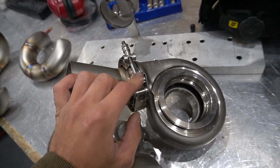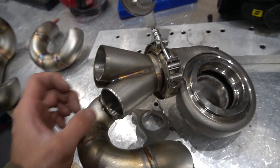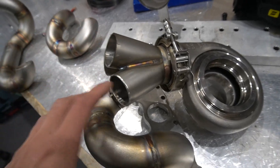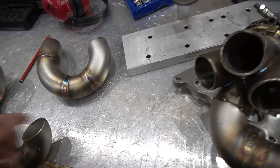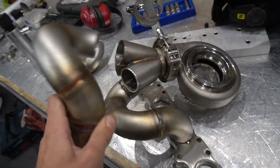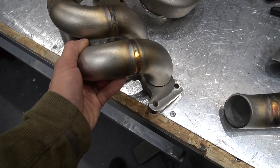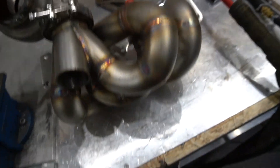Always bolt this to a turbo or another flange or something, because these just love to warp. You'll weld this and it'll start to pull — even though it's tacked here it will pull the flange and warp it and you'll end up having a bad time. So try and always clamp stuff together if you can. I'm going to get this welded up and then get this next section — how that goes in — it just needs a tiny little bit of fettling but it's good to go.